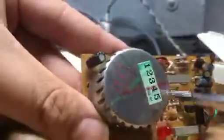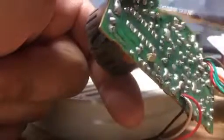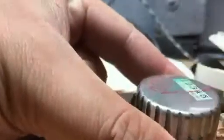You know what, let me take a moment here and go back through the rest of this. In a lot of these older smoke detectors, there's actually an application-specific IC, which you can see here by this dual inline pin row, the DIP on the back. That ASIC is usually open top, and that's the ionization detector, and then you have your americium source stored up inside the can. Some of them actually have a radioactive symbol on them, some of them don't.